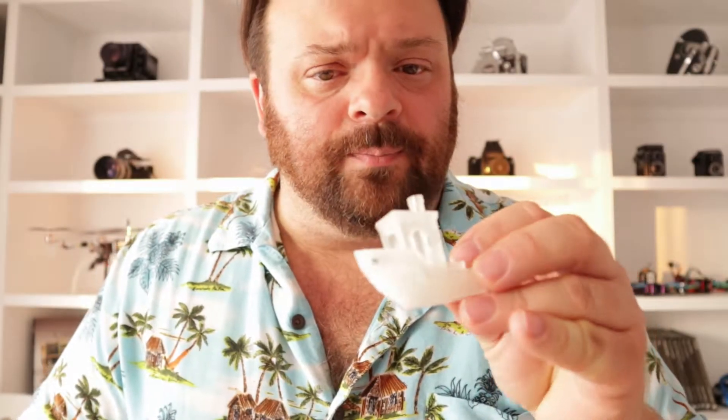I'm really happy with this stuff — it works just like regular PLA. I kind of expected it not to, just because it was transparent, but I guess that doesn't really matter in terms of PLA. I did notice it's more temperature sensitive for sagging, but it printed really well at lower temperatures too. I got good layer adhesion and no cracking, so I think it probably likes to be printed at a lower temperature.